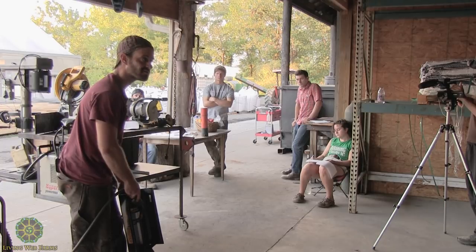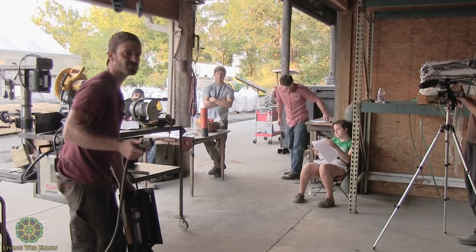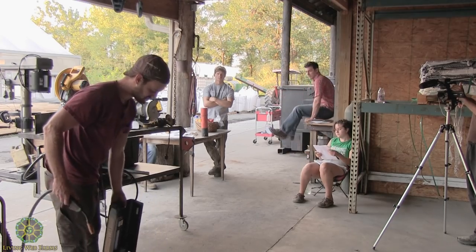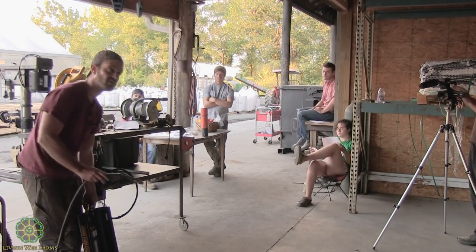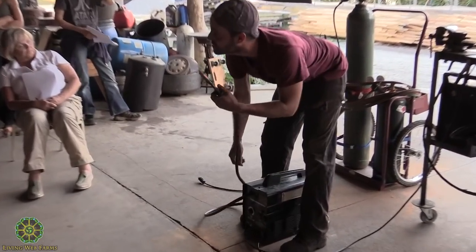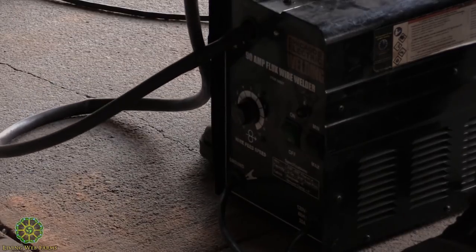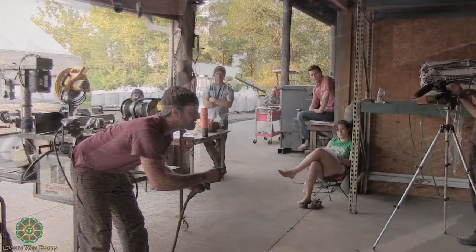It's not always perfect. In every situation, you might need to speed it up for some reason, so that's something you'll learn with experience too. Point is, start with the chart. This is what we're talking about. Wire speed, if I press that button, it's either slow or it's really fast. How fast it's feeding out of there. How fast it feeds out of here.